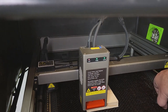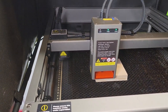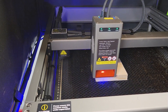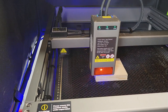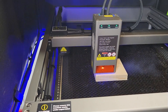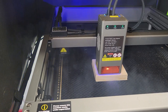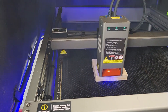I already have this set up with the first setting. First thing I'm going to do is frame it and make sure that we are all good there. As you can see, we're all perfectly fine on there, and we're going to go ahead and start the engrave. You can see — I don't know if you can see very well in the video — but it is smoking up pretty good. It definitely has a lot of flame, but the air assist is helping to keep that flame down. You can see it shining in the camera there. The air assist is keeping the flame at a manageable level. You can see all that smoke coming up through the honeycomb. Normally I would have my cover closed, but it's kind of hard to video this with the cover kept closed.